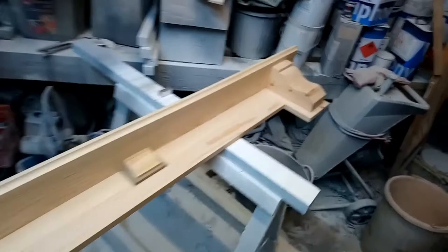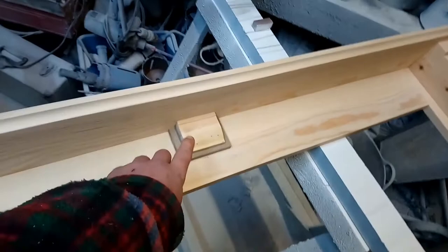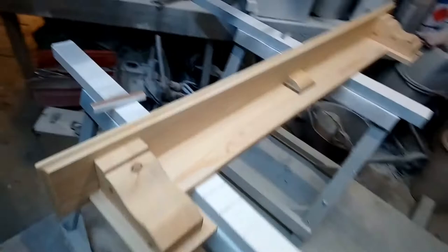It's finally time to spray this. I've got a little bit of filling to do on the scrolls. I've taken it to the job and fitted it - had to scribe it back. It's got a curve in it so I scribed it. I tried half a dozen different shapes from the ones on the internet and that's the one I settled on.